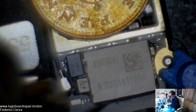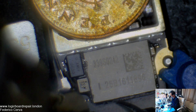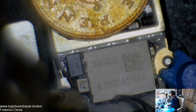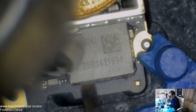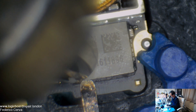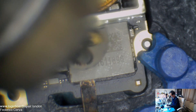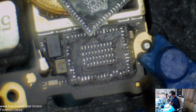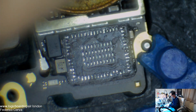And this is going to turn — just get in there, make some space for me to come in. Get up your temperature to remove. All you've got to do is get ready, wait for it to slide in, spin around, get ready to flip — and pop goes the weasel. No pads pulled. Very, very easy. Put this WiFi chip to the side to clean it later.